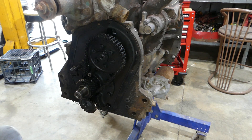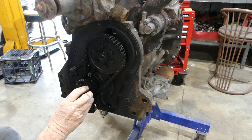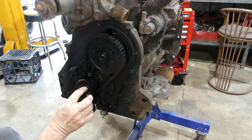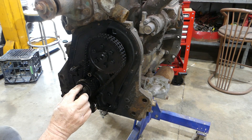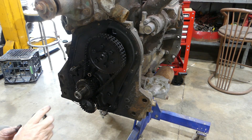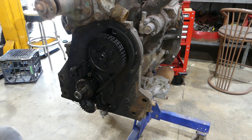Here's our timing system. This is the oil pump down the bottom. There's a washer in front of the crank gear — that's an oil flinger really. The pulley comes and bolts up against that, so any oil that wants to come down there hops on this lip and gets flung out so it doesn't get to your seal. That can go in the pot. Everything else there looks pretty good — it's what you'd expect to see.